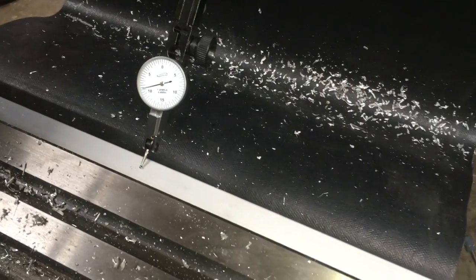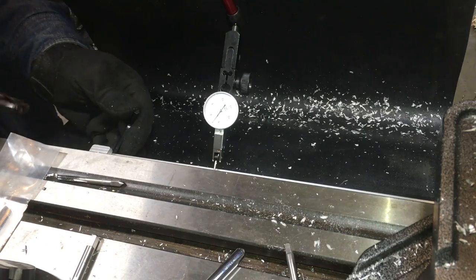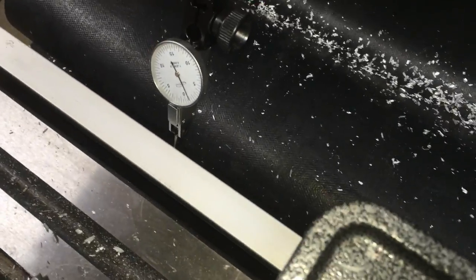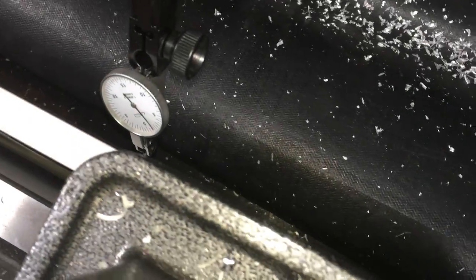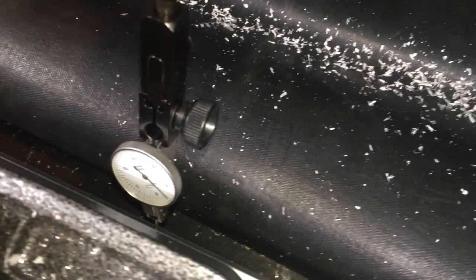After the X-axis scale was secured to the work table, I gave up aligning it at around a couple of thousandths off to either side of the zero mark through the entire range of motion. I attributed this flaw to the scale itself being warped.